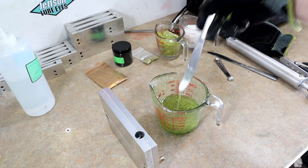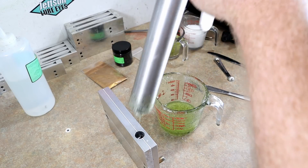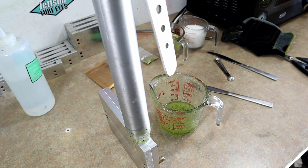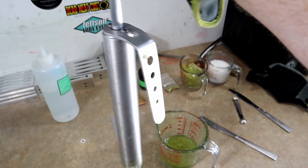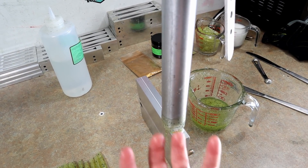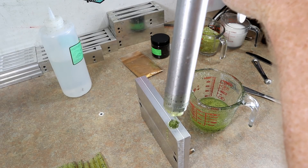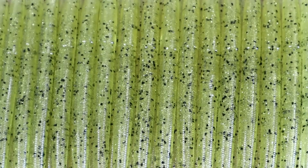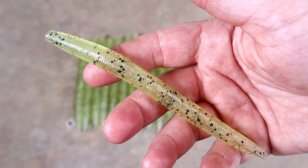Stirring up the plastic for another round of shells — still looks good. I'm making a lot of shells before actually testing the full color. Holding a little bit of arm pressure to keep the plastic injecting into the mold so it can't contract severely and cause dents. I'm also injecting at a really low temperature, which helps with that. There are the shells — it's such a light color I'm wondering how well it'll show up on camera.